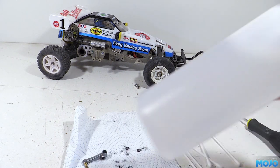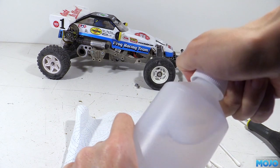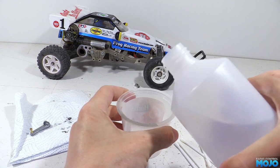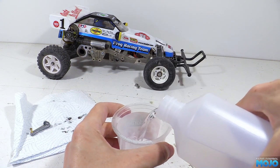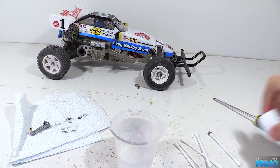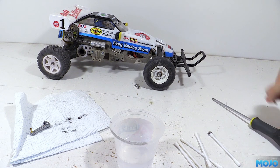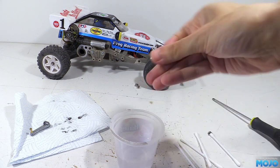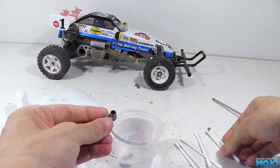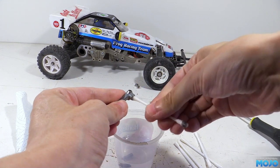What we need is in this rather nondescript bottle — I really wish they put labels on. Sometimes it doesn't even say what it is on the invoice and you have to give it a good sniff to figure it out, which isn't good. Anyway, we're using IPA, isopropyl alcohol, which does seem to be available again in decent quantity. 99% is good, but 70% will do too, it'll just take a bit longer for it all to dry out. We need to pour some into a pot, making sure there's enough to cover the upright completely, and right away we'll drop the spindle in for a good soak.